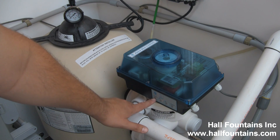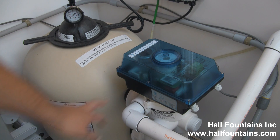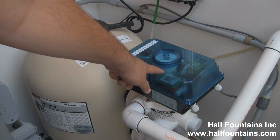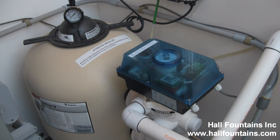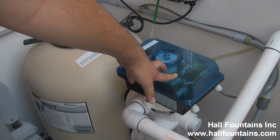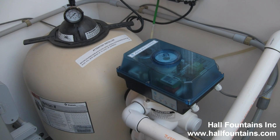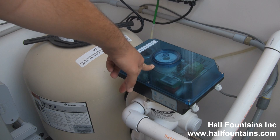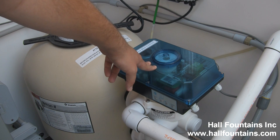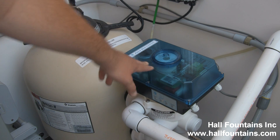This button here runs it through a test cycle. It's very important when you set up this backwash valve with a timer that you ensure the filter timer is also on at the same time the backwash timer is on. If the filter is not running when the backwash time clock initiates, the backwash will run through a cycle but the pump will not be on, so it will not actually backwash the filter — it will just go through the motions. This controller is not aware of whether the filter pump is running or not; it's a dumb system. It does remove power from the filter pump to ensure the pump is not running while rotating the valve during a backwash cycle, but it does not know if the pump was never on, so it will not backwash the filter if that's the case.